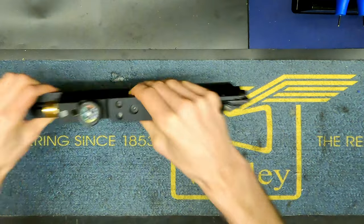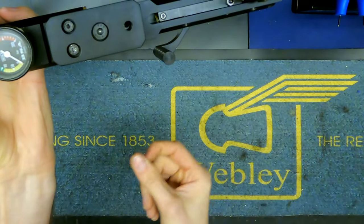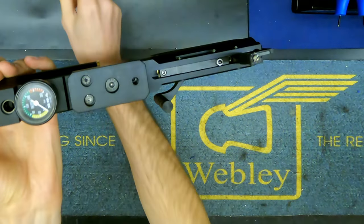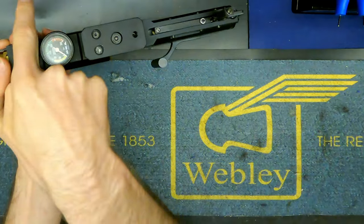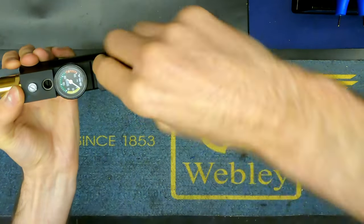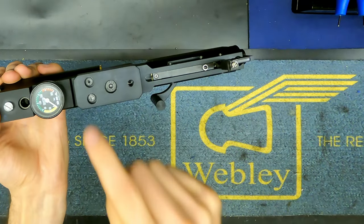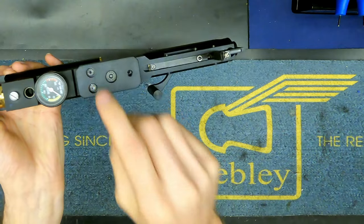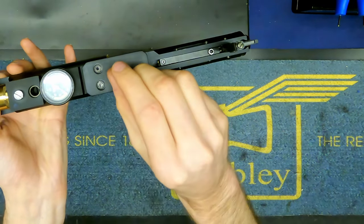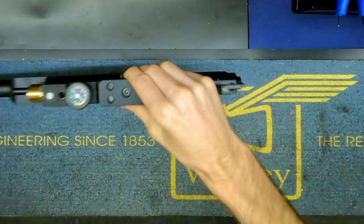You're not wanting to go all the way through because underneath there's these three screws as well. So you're just wanting to take it just enough and you can kind of get something in there and wiggle it out. Or if you've gone correctly in the middle, you can unscrew these screws and it'll pull them out as they come out as well. But like I say, you don't want to be drilling through. What I would sometimes do is put a smaller drill bit in and then go to a fatter one and just try to take the head off so you can get to the head there and unscrew.